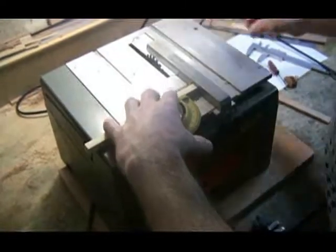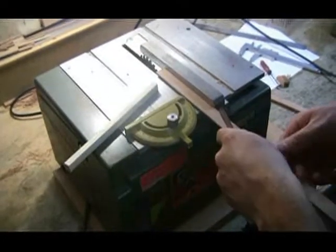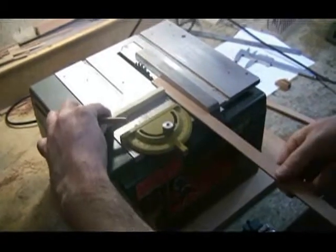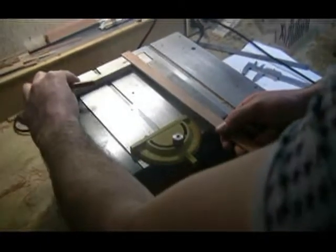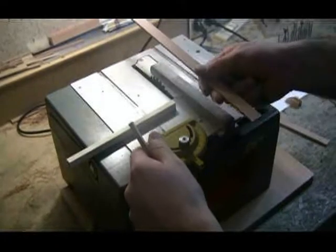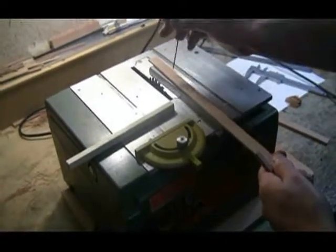The other thing is, when you're cutting a longer strip, something like that, and putting it through the saw, you want to provide both downwards pressure and pressure in that direction as well. So he uses this little device that he uses to mark nails on the deck and kind of pushes in on an angle like that. This pressure from this direction, however, should stop as soon as you reach the saw blade. So when this comes out the other edge, don't push it like that. That's going to cause the wood to burn. So as soon as you get past this area, stop the pressure from that direction completely and let it go through freely. Also, the wood should completely come out of the saw before you stop it in all cases. If you stop it while the wood's in the saw, you're going to get a ripped edge.